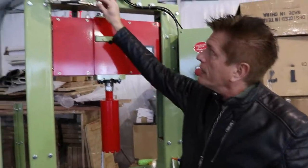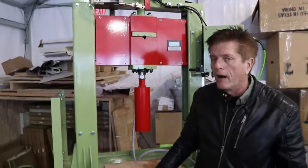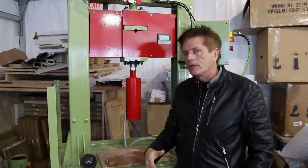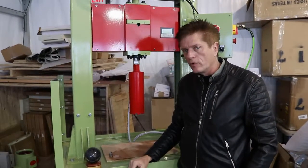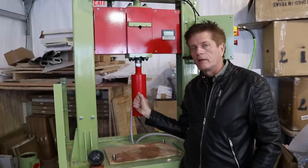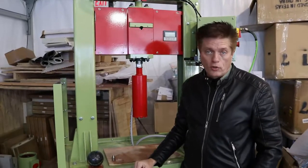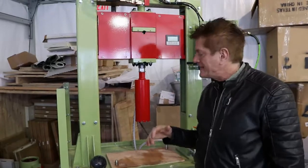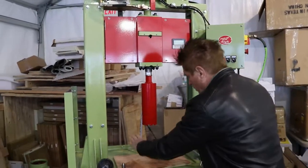There's not a jig that we're using to hold the rock. We've never seen that to be successful because that actually has you move more aggressively and have the likelihood of wrecking your bit by having it grab, break segments off, things like that. So you want to come in easy. This whole design is to be able to put your piece on there.